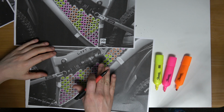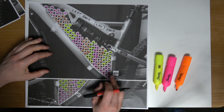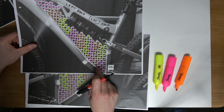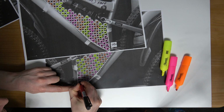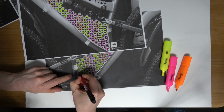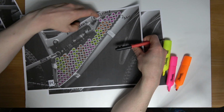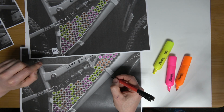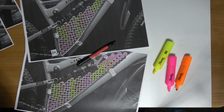So remember, this is the inside of the pack. So left bank, right hand side, the centre of the pack. So basically it will be the opposite. The polarities will be the opposite of where your left leg rests on the bike. So the opposite end of the cell. So starting with negative here. This will be the same as the right bank, right hand side face, sorry. So I can copy it. These plans will be really handy when it comes to placing the cells in this capsule. It's sitting beside me actually.